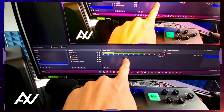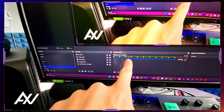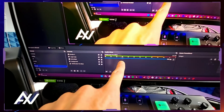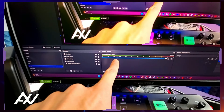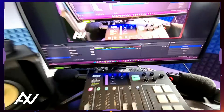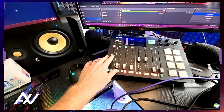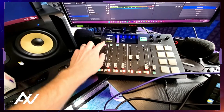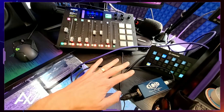Check my levels right here — I'm going to be quiet for a moment. See how there's no detectable background noise? No detectable background noise with my setup. It's because I got all my gains set up right — the microphone at the right gain, the right levels within the mixer — and I've made sure all my audio cables with my Cloudlifter are not touching other stuff. It really is that simple.